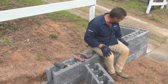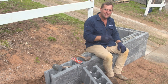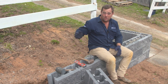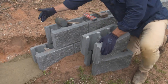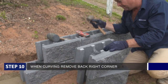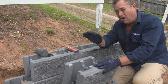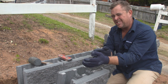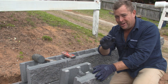Now you know I love VersaWall, and doesn't it look smart when you see it like this? The best thing about it — if you can lift a block, you can make this wall. It's that simple. But did you know you can make curves with it? Whether you want to go out or go in — concave or convex. If you're going out, you just start laying the blocks and you leave a small gap at the back. If you're going in, you need to grab yourself a lump hammer and knock off the back right hand corner, and do that for the whole course as you're creating the curve. You can't be too ambitious because the next course will sit and hang over the top of it, and it won't look very nice. But if it's a nice gentle curve, it looks a million bucks.